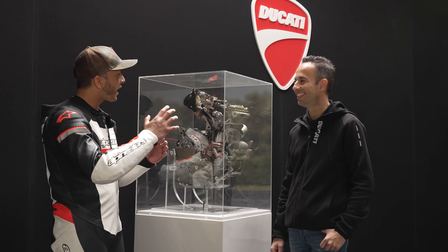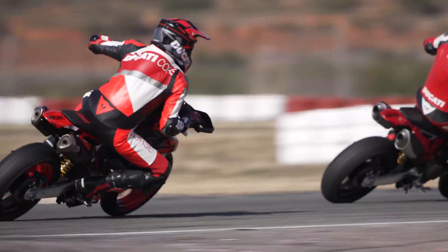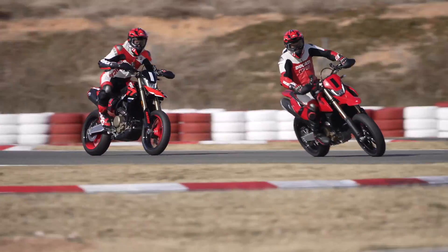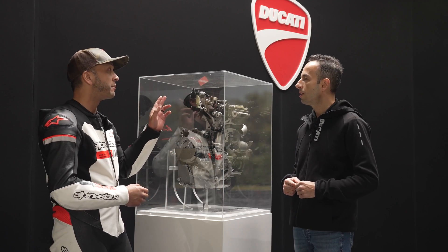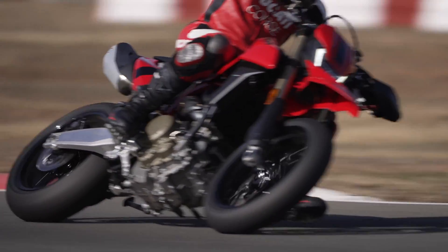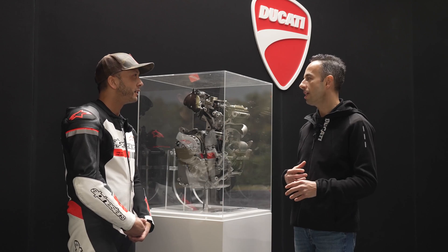That's an incredible number. So with a single cylinder engine, how are you able to reach such a high rpm? The starting point is the twin cylinder that has a 116mm bore and a very short stroke. With this extreme bore-to-stroke ratio you are able to reach high rpm. The connecting rod is steel, and then it was titanium intake valves and steel exhaust valves — so theoretically there's still room for even higher rpm with titanium connecting rods or titanium exhaust valves. Yes, you would also need to set up the intake and exhaust system to go higher in rpm.